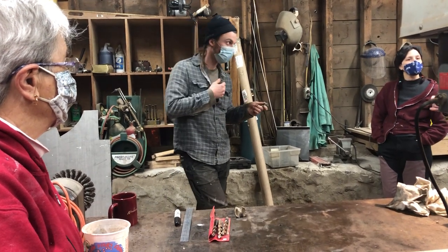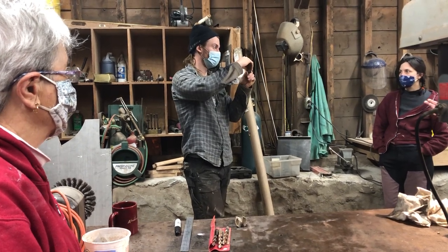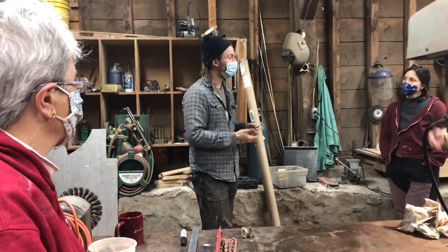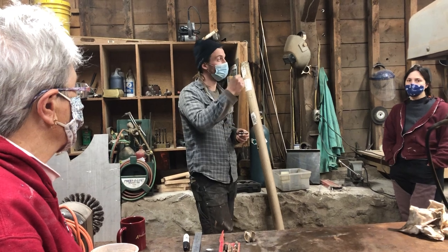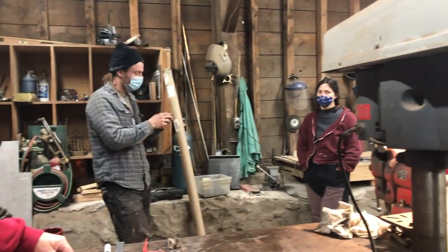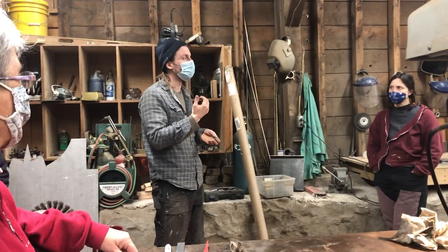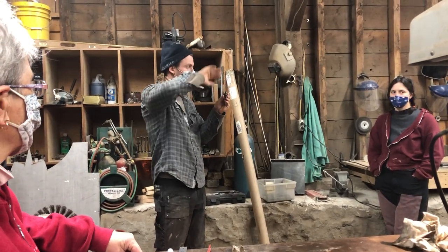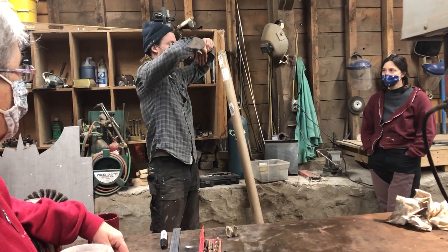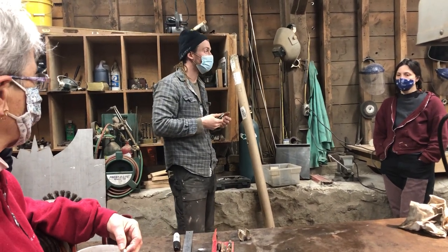You're mentioning a burr. You don't want the burr in there? You don't want the burr. You do not want a burr in there. I mean, think of the burr as being on the inside. And how did it create a burr when you're using it? Or the drop. If they get dropped, or run into the steel bed of a press. But just using them in wood is not going to. It can. It's the same way that the edge of your plane blades can fold over. You've got this very crisp edge, and you're forcing it down into the wood, and the easiest point for it to fold is up in the end. Right, right. Yeah. So you can develop a little bit of a burr.